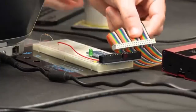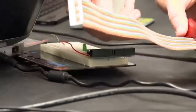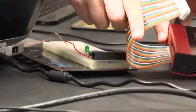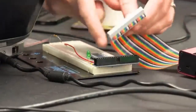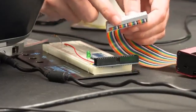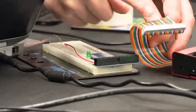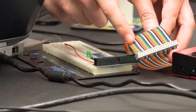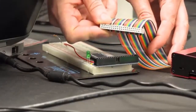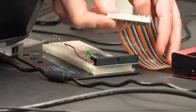So I have this, what we call, a cobbler. I'm going to see if I can get in here just a little bit closer. This is a GPIO cable coming out of the side of the case, and it's plugged into the GPIO on the Raspberry Pi, and inside it looks just like that. So it's just an extender. The inside GPIO has been brought along these cables and into what looks like an old IDE connector. It's a 40-pin GPIO connector.